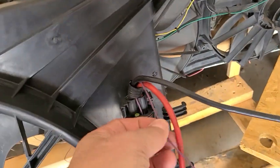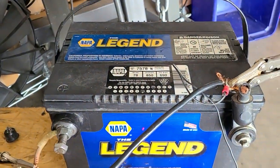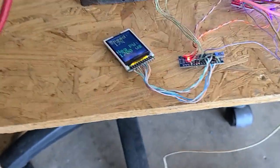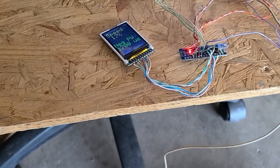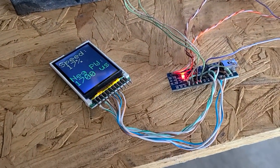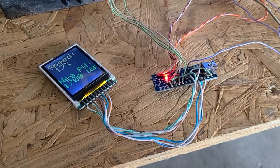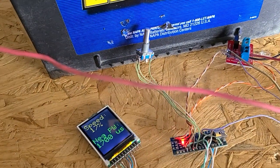You've got a purple wire that controls the pulse width modulator coming in, and two big power wires that go straight over to the battery. To control it, I'm using an Arduino. I programmed it for 122.5 hertz, and I use a rotary pulse encoder to vary the speed.